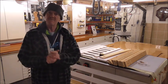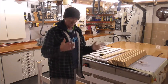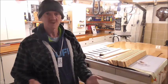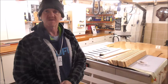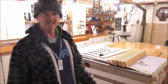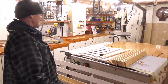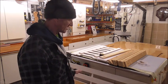At the end of it, everything wants to be white. Now, when doing this lot, to do it quick, do it clean and make it match, I always find white stone paint, a clean, smooth white stone paint, does a beautiful job, and it lasts very long, and it's good and washable. So if you've got it around, use that; if not then use whatever you've got, but basically just making it white. Emulsion, you're going to be using 10 coats before you get a solidness to it. But with a stone paint, 1 coat will probably make it just as good. And that's it, the country board and all this is already painted white anyway, so that's the theme, get it all in white, spindles and all.